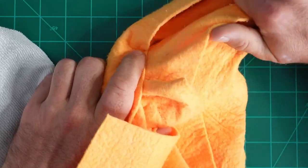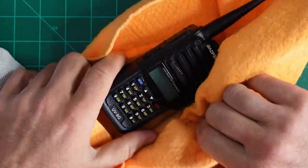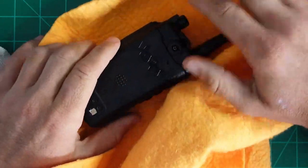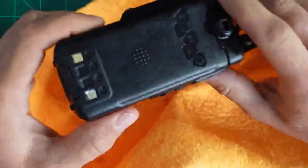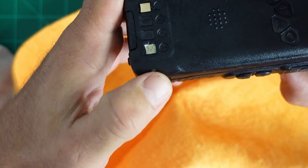They're all essentially the same radio. Even if you look at the FCC ID, they're the same FCC ID. The only difference that I mentioned here is that this casing is a little bit different. And my assumption is that the casing that they had here is probably designed a little bit better for this IP67 rating. You'll notice here the corrosion on the battery terminal, and that again is common with any radio.